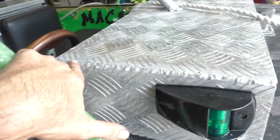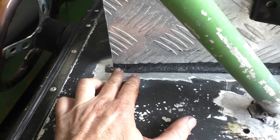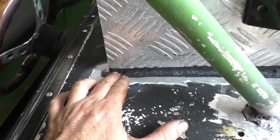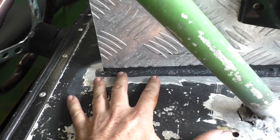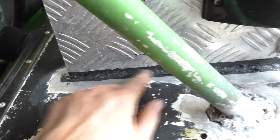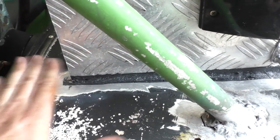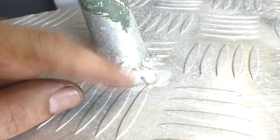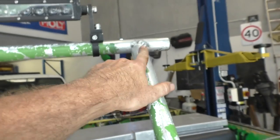It's been a few days now since I was last working on the green machine. I had a bit of a cold at the time and the welding wasn't going well so I didn't see the point in filming me just being grumpy. I've got this top glove box section on now - I just welded the edges along here. I welded it onto the deck but it's the classic thing with welding - the actual technique is not that hard but it's all the finer points. In this case it was heat management. Even with small tack welds this thin deck tries to expand and either wants to pop up or pop down. It can't go up because the glove box is blocking it so it drops down. I ended up with a series of almost like little columns where the deck had come away. This aluminium has got a very hard oxide layer, worse than the boat itself surprisingly, so I needed to scrub it better, which meant it was very hard to get a puddle on it. I'm going to keep working around here - the support post up to here.